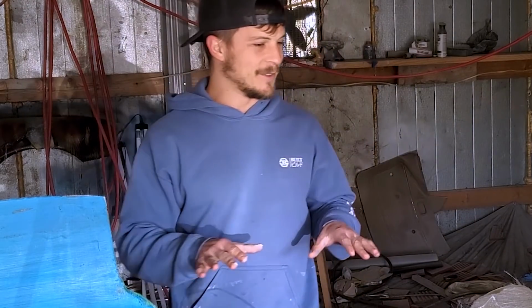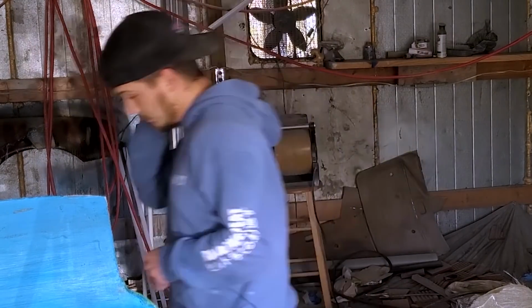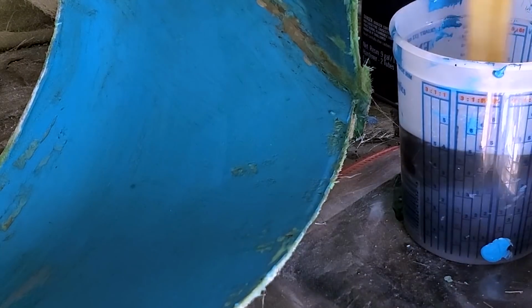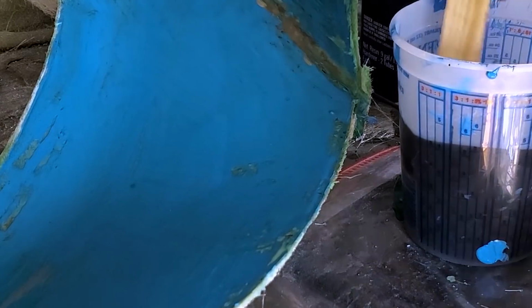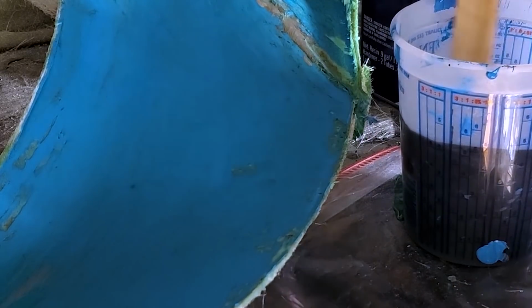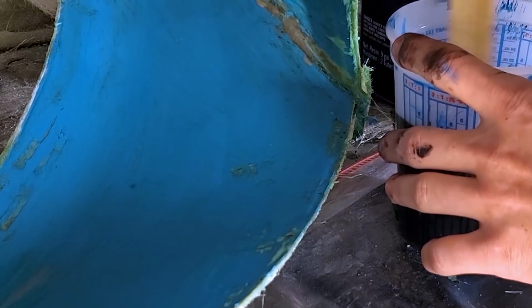All right, I'm gonna let this glue dry while we mix up the black gel coat. Whoa, that went black real fast. So we're gonna mix each thing individually, ending with the MEKP. That's when I'll put the respirator on. You guys won't be able to hear me as well, so that's what I'm telling you now. We'll make sure this is mixed in really well.